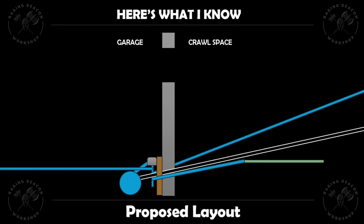As far as electricity goes, the electricity that's coming from the main box, I'm going to get a junction box. We'll run that into a nice junction box. We will then run it up to the pressure switch, and then we will take the wiring that is going to the pump. We will also put that in a junction box, and we will run wire back from the pressure switch to that junction box back there.